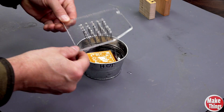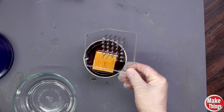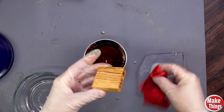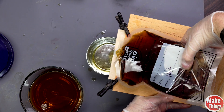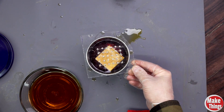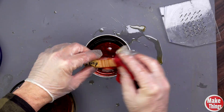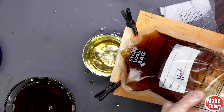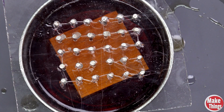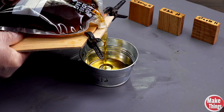For the first test piece — oak — I topped off the oil before lowering the plunger. Ten minutes later I removed the piece, wiped off the excess oil, and stood it upright on the glued edge to cure. Then I dumped the used oil and replaced it with fresh hot oil for the next block, maple. Interestingly, this was the only warm sample where I noticed bubbles collecting at the top. After wiping it down, it was time for cherry. A close-up shows that the cherry didn't produce any visible bubbles.